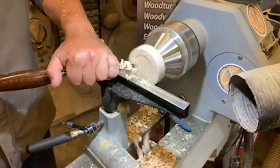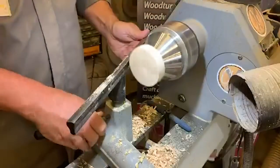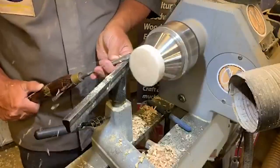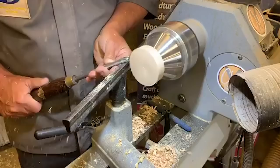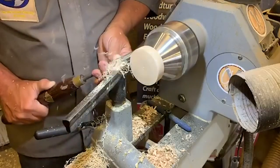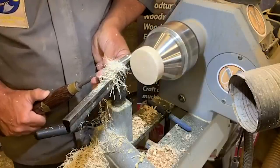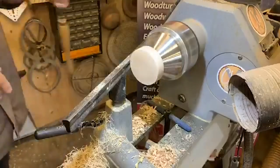If you look online at Räuchermänner and German nutcrackers, you'll find some heavily decorated in colour and some in natural timber colours. For natural colours, use something with nice grain — burrs might be a bit too much, but something with a nice dark coat. Since this one is going to be coloured, this is maple. I used an awful lot of sycamore and lime for all of these German decorations. I'm dropping the handle nice and low — that's going to give us a nice skew cut. I want it dead flat.